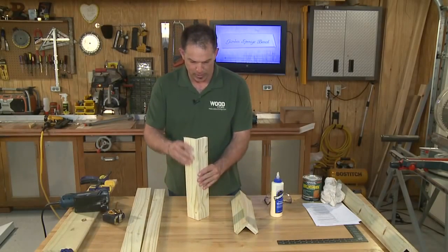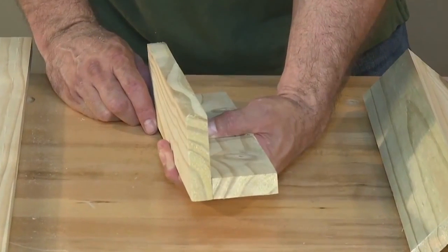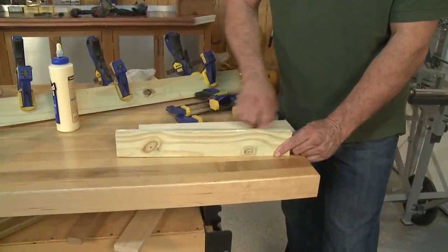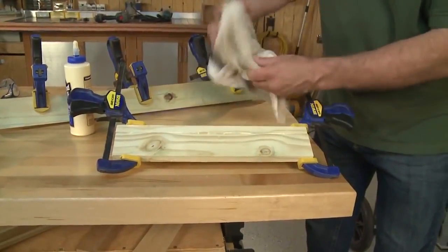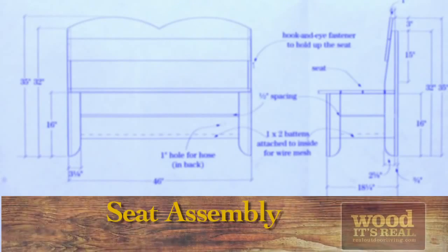You want to find the pretty sides because we're going to attach them like this to make something of an L. Once we find the pretty sides of our wood, we'll get out the glue and some clamps and put them all together. Spread glue evenly along the edge of the narrow strip and use clamps to hold the setup in position. The leg blank should measure three and an eighth inches on both sides.